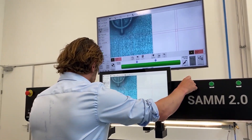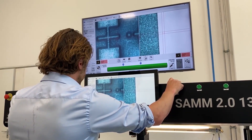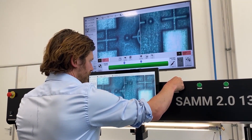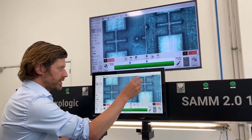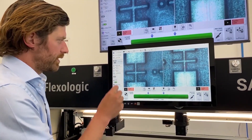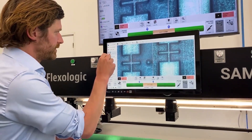Using encoders on the cover of the machine, I can position the cameras. I want to position the cameras on my mounting marks, and the machine has machine learning capabilities — it's actually recognizing the positions of those mounting marks. Using the machine, we can say 'measure the plate' and it will automatically fill in the plate width target to target.